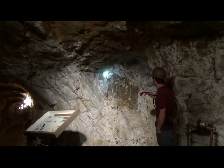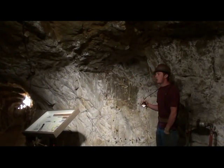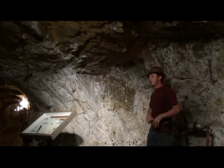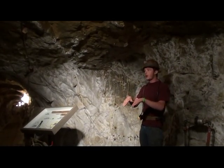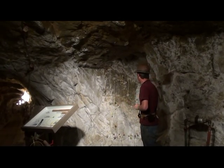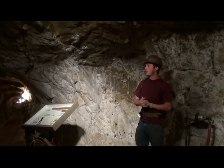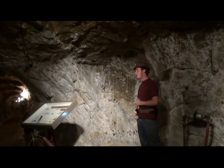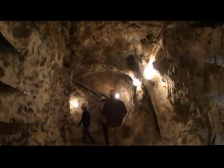Our 4th blast is our back. Last but the most important, they're called the lifters, and they're down here on the floor. Now your lifters, they're drilled at a 30-degree angle, and they're going to shoot the rock off the heading, off the back, and onto the floor right about where y'all are standing. This way you can start to muck it up, and we can go ahead and start drilling it again.